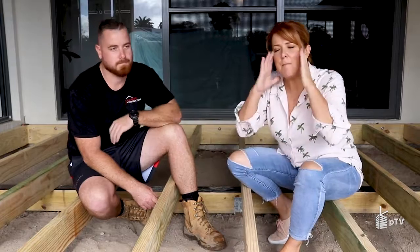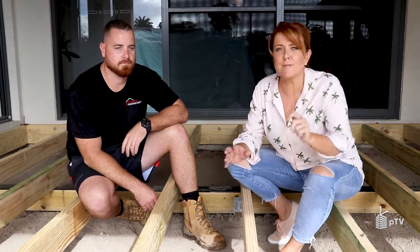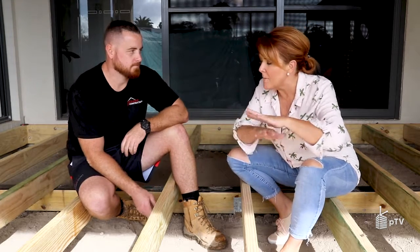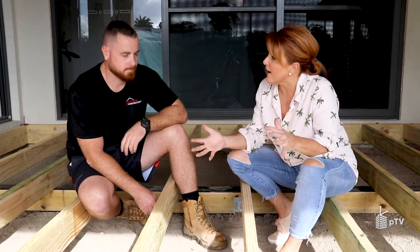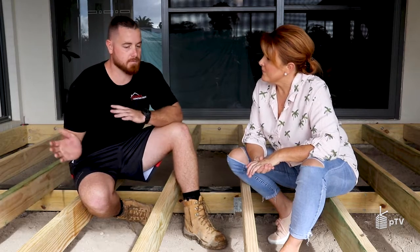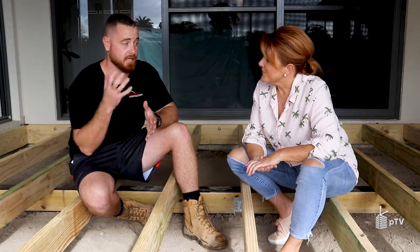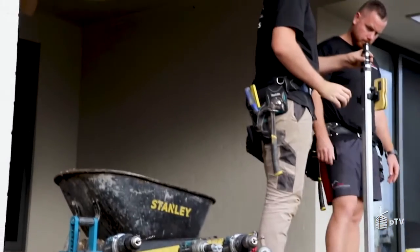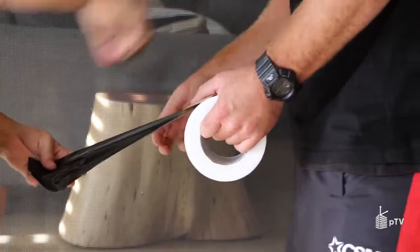When you're about to lay a deck there's a pile of things to think about — lighting, connecting outside to inside, stairs or platforms. I have Jono with me today to talk about everything below the decking boards. If you're keeping your old subframe, the first thing is to get a chippy or builder in to look at it and see if it's structurally sound and strong enough to take the weight of the new boards. Trex boards are quite heavy compared to other decking products. You also want to check your joists are level and flush.